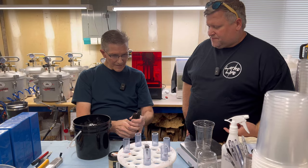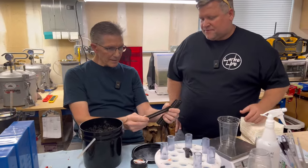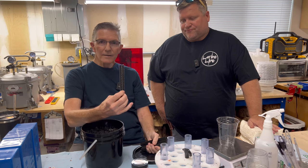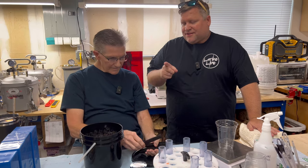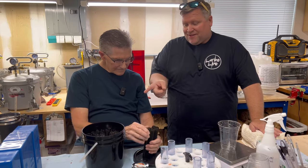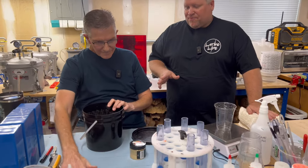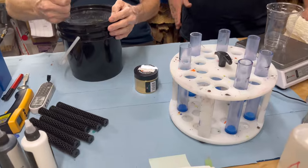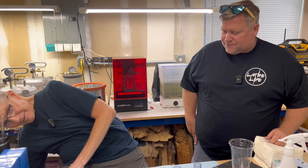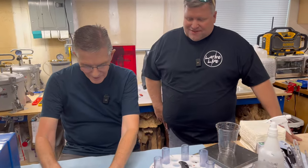This is a proprietary mix of resin — there's some flexible resin in there as well as some ABS-style resin, but you can see there is some flex to it. These are details that are important, because if you just bought a printer and started casting you wouldn't know this. If you leave those out in the sun too long — I'd say a day — they'll get too brittle.